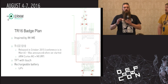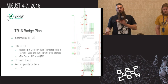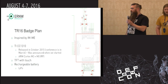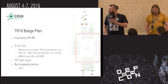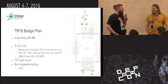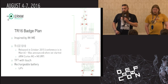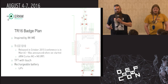Another thing was how do we communicate with people? How could they use the device? On the conference, nobody wants to attach this badge the whole time to their laptop. So we were really lucky with a cheap TFT LCD screen with touch, and this worked quite well. We got no problems, okay except for the driver, which we had to write for the Contiki real-time operating system. We also used lithium polymer batteries as a power source.